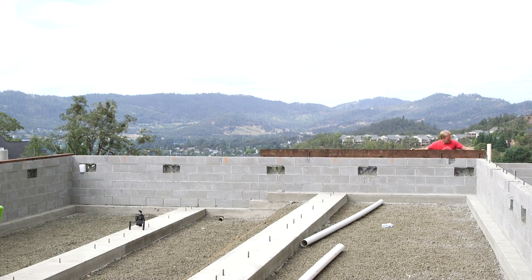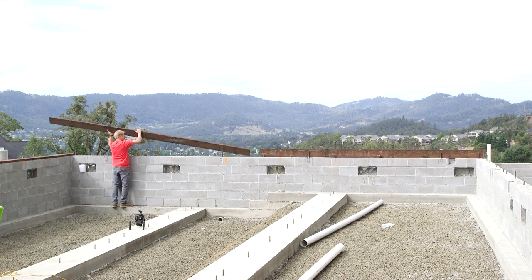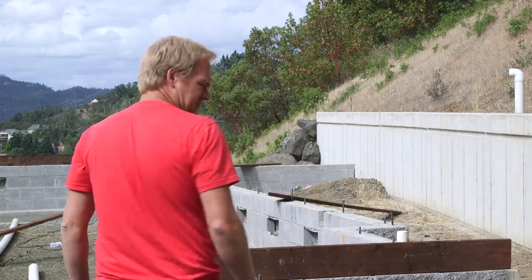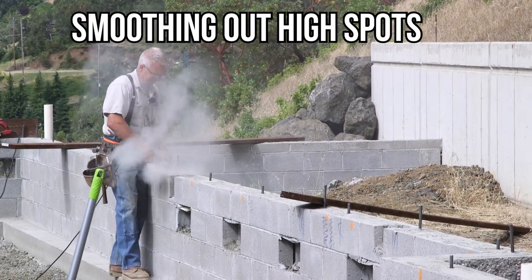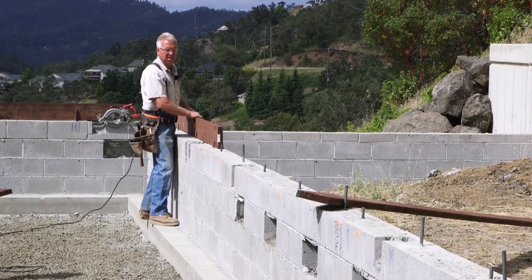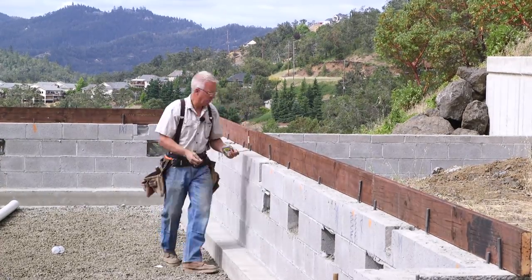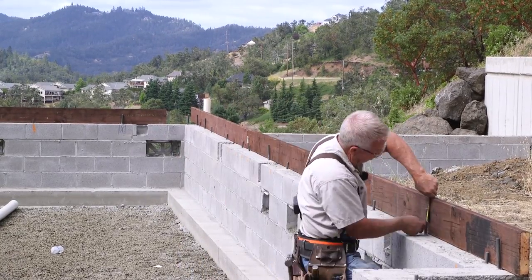Just a little word about this pressure treated lumber. It's a totally different animal than any other structural lumber that I'm going to use in this house or that really anybody uses to build anything. Pressure treated lumber is a little strange. A lot of times it is made from a lower grade lumber to begin with. This particular unit is different - this is good old Doug fir and so the boards are pretty darn good, even though it's not an exceptionally great grade, at least it's not the standard variety hem fir whitewood stock that pressure treated lumber is most often made of.